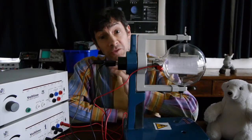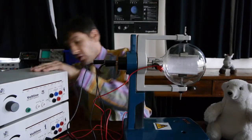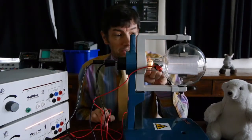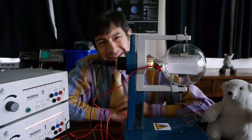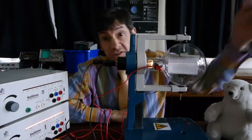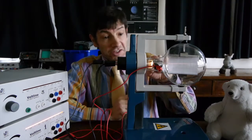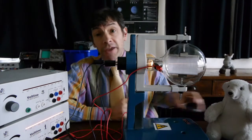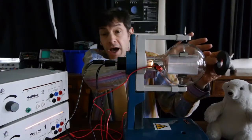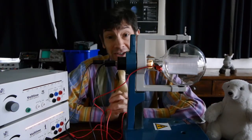Just before we get started, there's one thing I'd like to do. I'm just going to disconnect the accelerating voltage and turn on the filament. You might see a glowing here in the tube — that's where the filament is. It might be a bit too light in here, but when you do this at school, you often see a stripe across this screen. And it's really important your teachers point out to you that this is not an electron beam — this is just light from the filament. They can prove it to you by bringing in a magnet, and if they bring a magnet anywhere near that, it doesn't deflect. That's just a light ray.